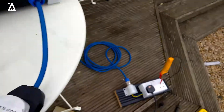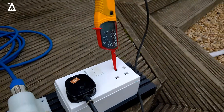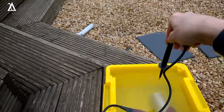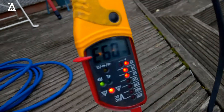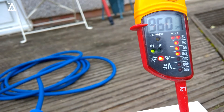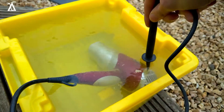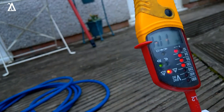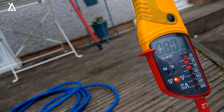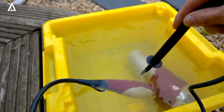I've got a voltage tester, and since it's making contact with earth on the socket, I'm going to dunk this probe in the water and see what voltage we get. We're getting about 94 to 95 volts, and it's increasing if I dunk the probe in further. Going up — 100 volts, 113 volts near the end. So yeah, you wouldn't want to stick your hand in that.